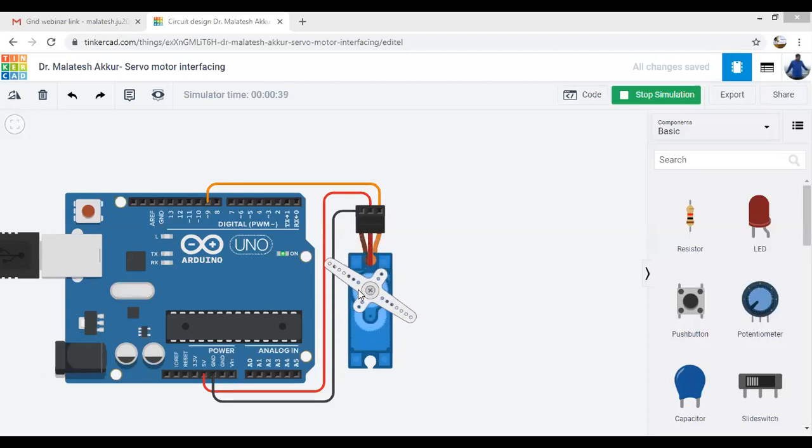Basically, if I want to make this rotate continuously, through the full 360 degrees, I feel that PWM, what is mentioned on the other pins, pulse width modulation is where it can control the degrees. Exactly, correct, sir. Because the endpoints of that servo, many servos can vary only through about 170 degrees, as you were rightly saying. Yes, sir. So we can make it 360 degrees, not a problem, sir. That's nice. So these are usually used in industrial automation.